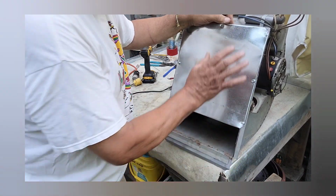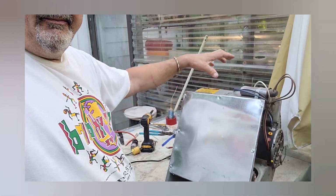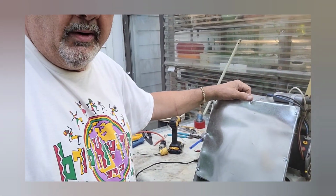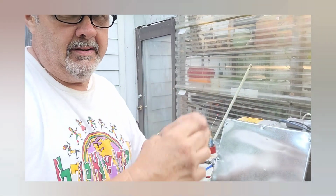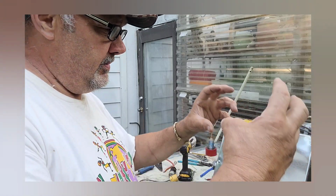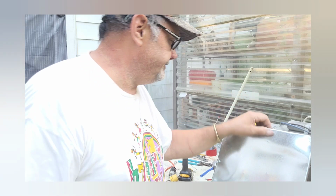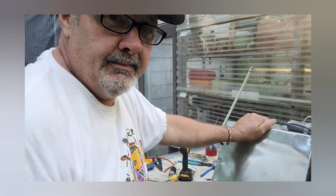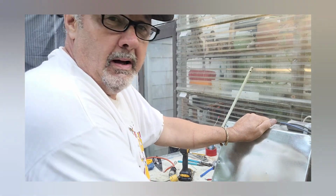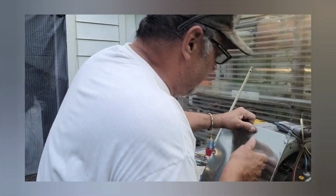If they're direct drive, you're gonna have to block them. Otherwise, they'll have the motor on top with a pulley drive, and the way to speed them up, you tighten a pulley. It's kind of like a bicycle. The more you turn the pulley in, the faster it'll go. The more you turn the pulley out, the slower it'll go. Just so you know, on a pulley driven one of them kind, you don't really need to block the airflow. Them don't matter.